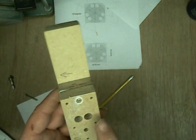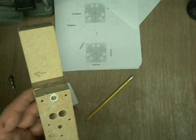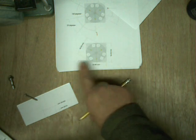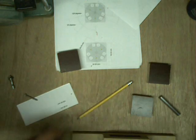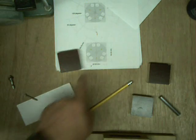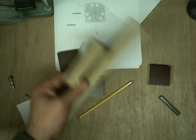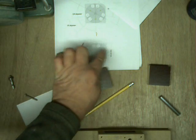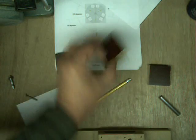We'll cut this timber, we'll drill all these first, then we'll make it into a round shape - otherwise we're going to get breakout. So the first thing is to cut these blocks - as you can see, 50mm square out of my usual timber. That's my three blocks cut. Cut our labels out, stick on, punch the holes. I'm only going to punch the centre hole in these because the jig will do the rest of the work. Crucial thing: don't round these off first, drill the holes first - otherwise you're going to end up with lots of breakout. So we're going to drill all the holes first.